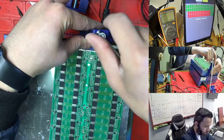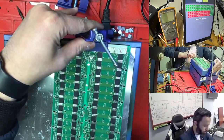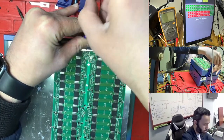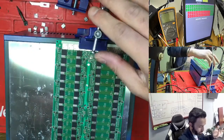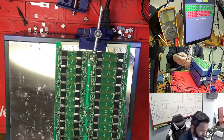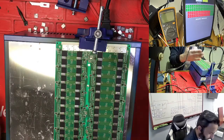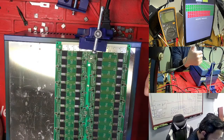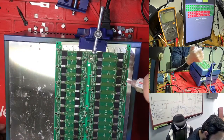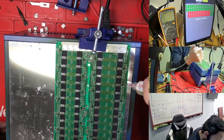But you can take two clips. Anytime you change any hashboard, one is put aside because too much heat is coming, so you cannot touch it very well. So one you put aside to cool. So another one, till right now, gives you time, so you need to test your other hashboard. So I'm adding a flux here, after then I'm leaving it till it's ready to take out the chip.